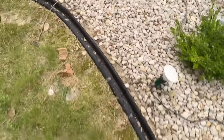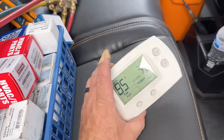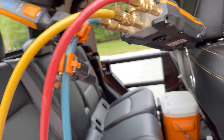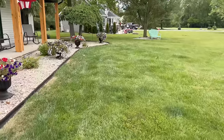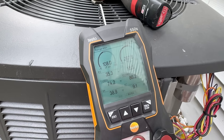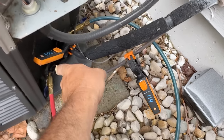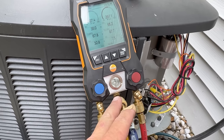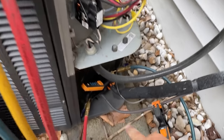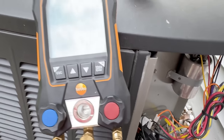We could probably check the charge. We brought a junk thermostat just in case, got a contactor just in case, got my new 550s here. We've got it on 410A. Running a 35-degree evaporator, which is fairly cool in there — it's about 75. And it's 95 condensing temperature. I've been starting to letter those with blue paint markers to make it easier. Superheat's 33. I've already bled all the way up to my middle hose, so we're bled and sealed. When we get done, we'll valve off our liquid, dump it back in, and disconnect. Technically we're running a 7-degree sub-cooling. This is 14A, which always loves to take forever to stabilize.